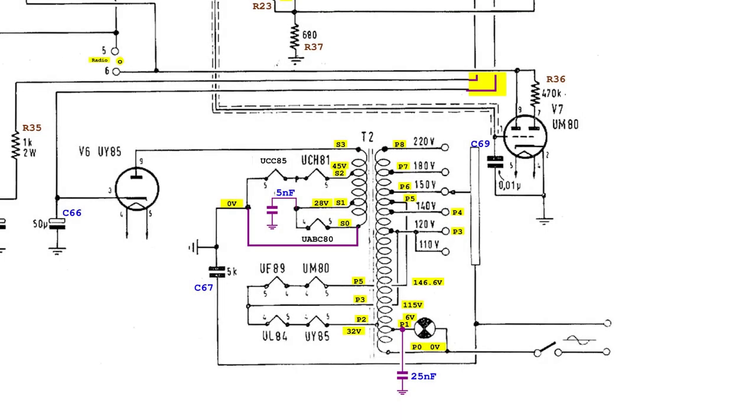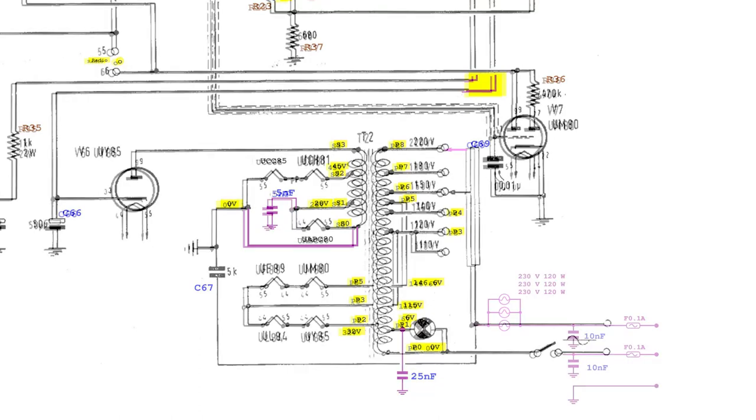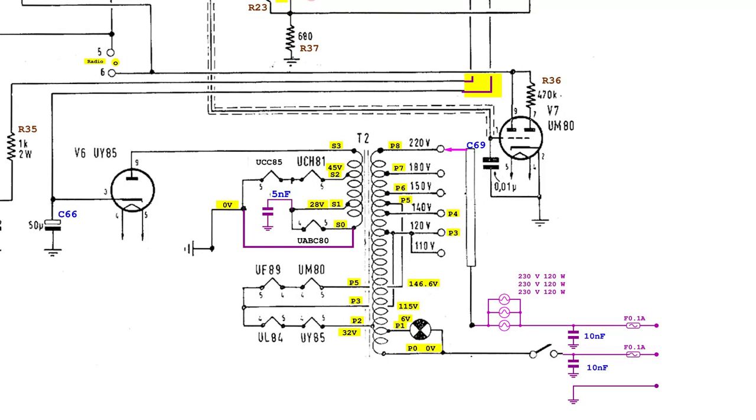In Europe, the domestic mains provides about 230 volts, while this radio was made for maximum 220 volts. Three halogen light bulbs have been put together, in series with the supply line, but in parallel with themselves, to drop some voltage, and two fuses have been added too.